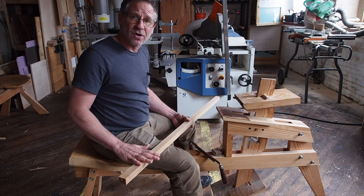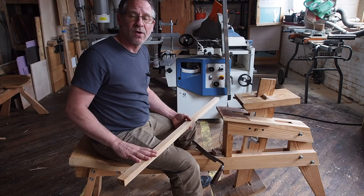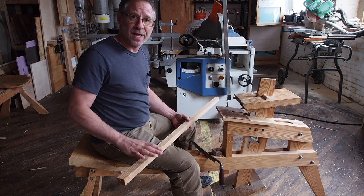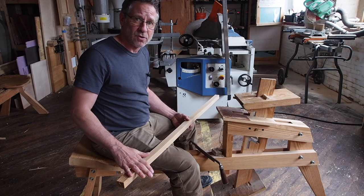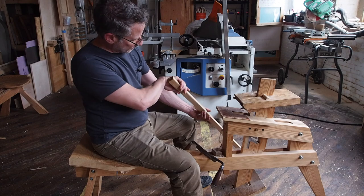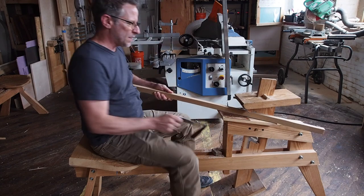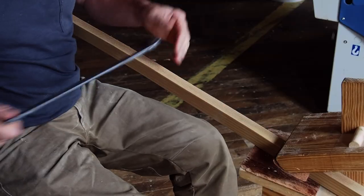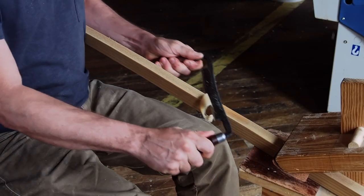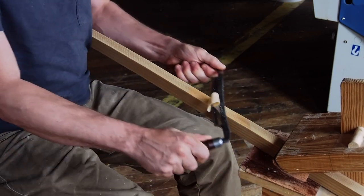This one is quite riff-sawn, so in this case, what I wanna make sure I do is I stick with what I know about the edges. So I wanna go to my edges first again. Just like when I was splitting and sawing the board, the edges are what counts first, then I'm gonna take care of the face. So first I wanna make sure I'm working from the edges, so I'm gonna start just like you would see me do before with any piece of wood that I'm trying to shave at a shave horse. I'm gonna go to the middle here, and I'm gonna take a nice shaving, and you can already see how nicely that cuts.